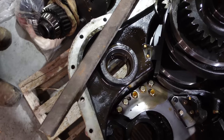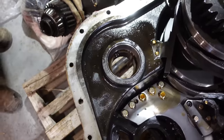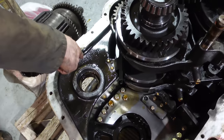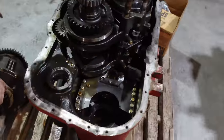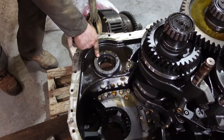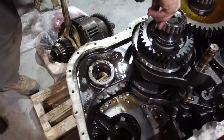Which one was this? That thing? Yeah, it drives the hydraulic pump. Okay, and that just lifts right up. Yeah, right? And I think that's your low speed, because it's a 24 speed transmission. Okay. Right, so then that gives you an extra. So that's your high low clutch. That gives you one extra speed, right? Driving from your input, like from here to here. Yep. It drives through that countershaft. Then the rest is the same. That's pretty much the only difference between this and a 12 speed, there's a clutch here to go high low. Okay. All the rest of it's the same as a 12.